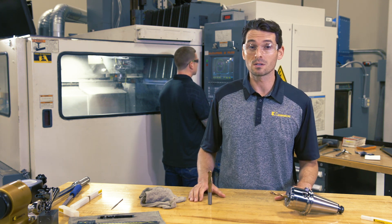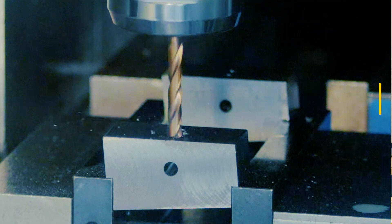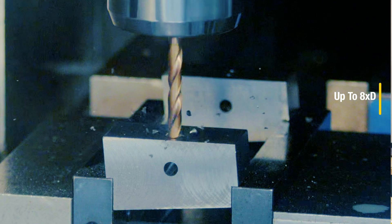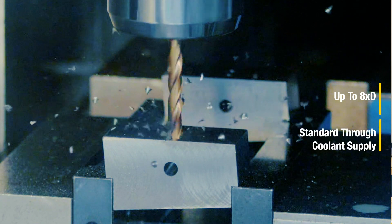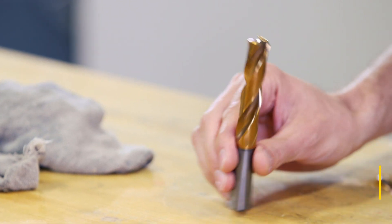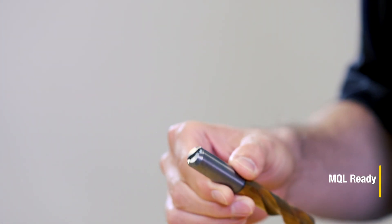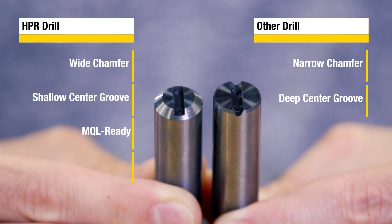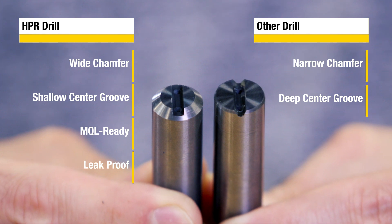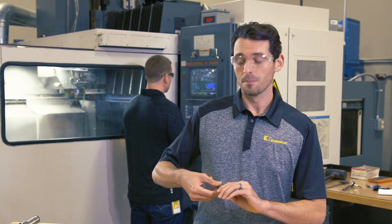It works when you have unstable conditions such as unstable workpiece clamping or thin wall components. No matter how you apply the HPR drill, it's available up to eight times D and comes with standard through coolant supply. It's also MQL ready — all shanks fulfill two DIN norms for minimum quantity lubrication, so you can run it either with flood coolant or with minimum quantity lubrication. The new features on the shank provide a leak-proof system.